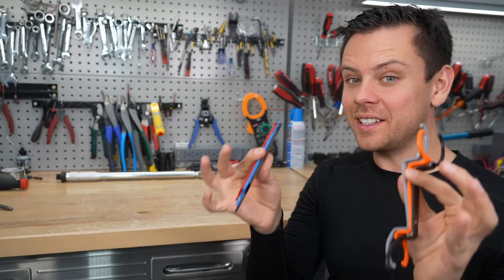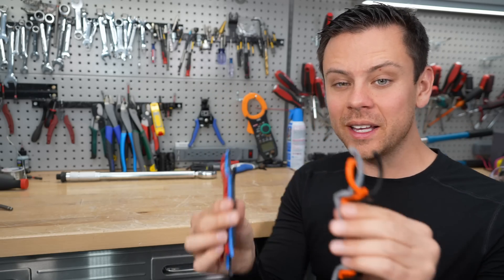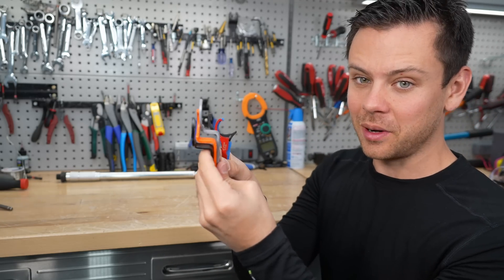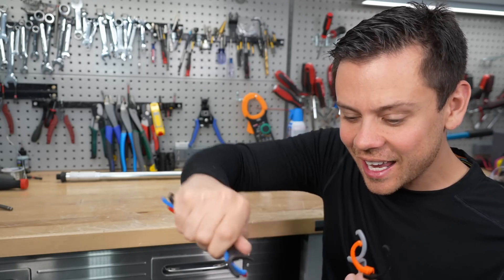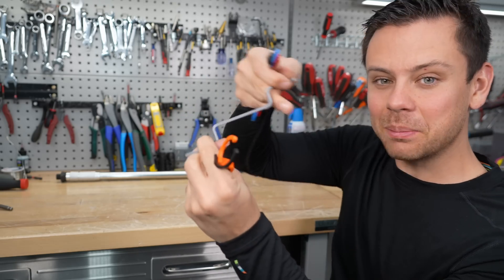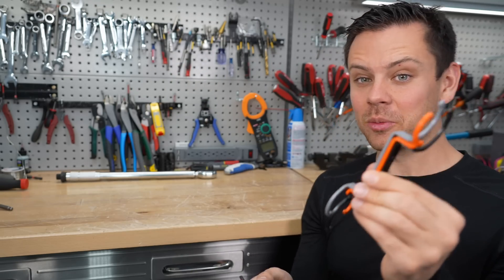This was a recent find — everybody that has flat lock nut wrenches should replace them with these 90-degree ones, because they work a lot better inside an electrical box. I had no idea these actually existed. If you're still using flat ones and trying to do it at an angle, you're going to have a bad time. This one goes right in there and you can spin it around a lot more. These are very common in any hardware store.